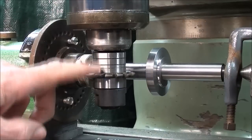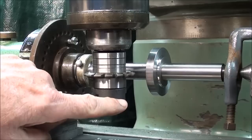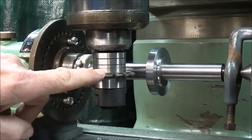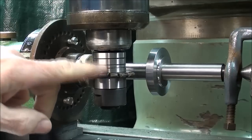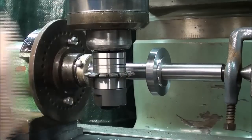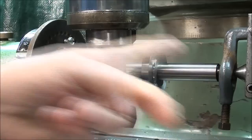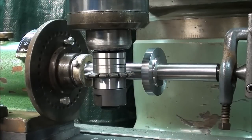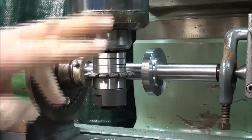The number four cutter is mounted in an arbor with a three-quarter shank held in a three-quarter collet. Notice I've got it mounted so that when I turn the machine on in forward, that is the correct rotation for cutting. Don't ever run one of these cutters backward — it's a form cutter and you'll dull it instantly. I like to have it going clockwise, feeding this way toward the dividing head and toward the large end of the mandrel, which tends to drive it on farther should it be slipping.